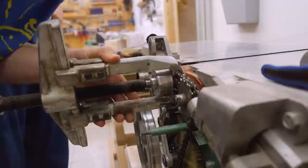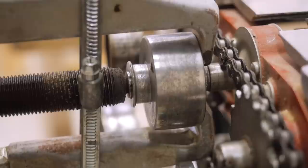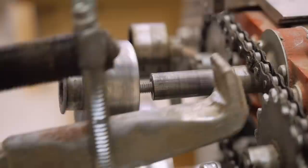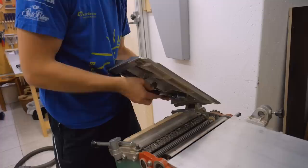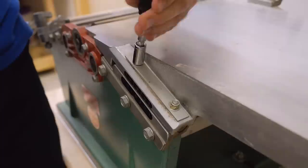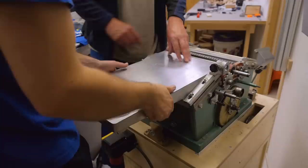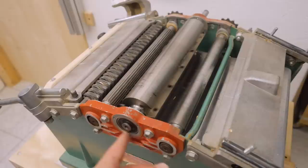When we had to get off the old pulley, we kept slipping with the gear puller, but with a hose clamp keeping the ends together it worked. The other parts I already had taken apart when I bought the machine, so that was easier. With all the tables removed, there's actually not much machine left, and unfortunately to get access to the cutter head and get it out we also have to remove these bearing housings which also guide the feed rollers. Basically we have to take apart the whole machine.